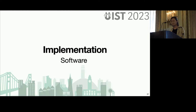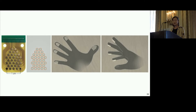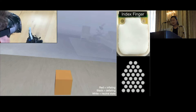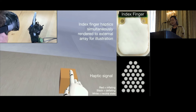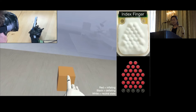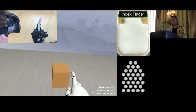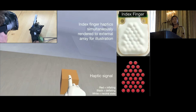Now for our software implementation. We created a PCB prefab that matches the placement of the pumps exactly, and we attached these to the Oculus hands module at roughly the same locations as they would be physically. Each haptic pixel has a collision script so that when it collides with objects in Unity, the appropriate serial command is transmitted. The collided pixels on the index finger are shown in red on the bottom left, mirrored above on an actual array. You can see the user touching the face of the box and then sliding the finger off the edges.